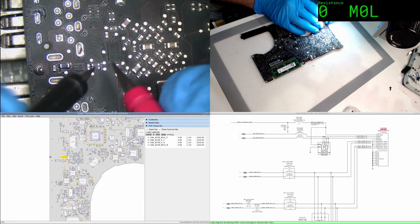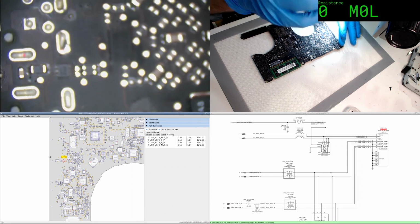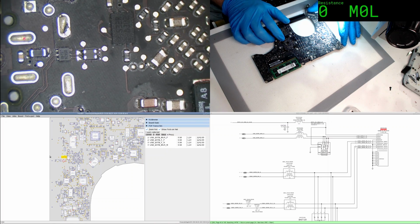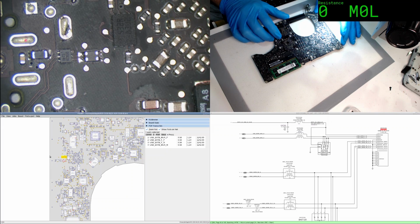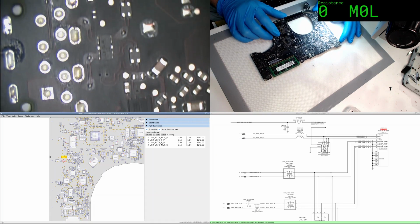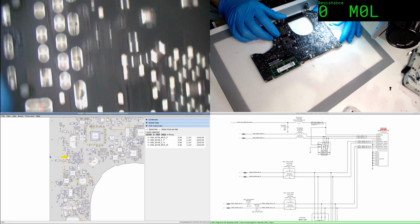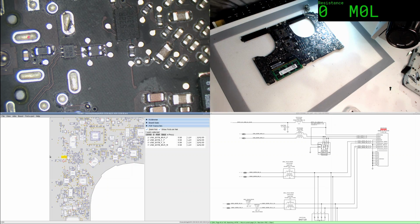And if you're wondering why I picked that, it's just because it's unique to the port, and it's where the data flows when you get in power. And so it was just my first suspect, and they are known to fail. And now that I look at it, it's interesting. There's actually solder around there, fresh solder. Okay, well, I'd say let's replace that, and maybe we get lucky.